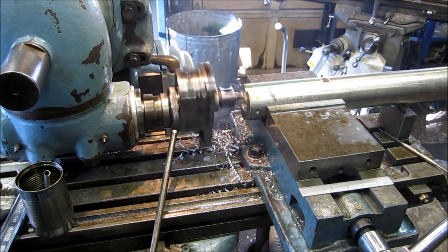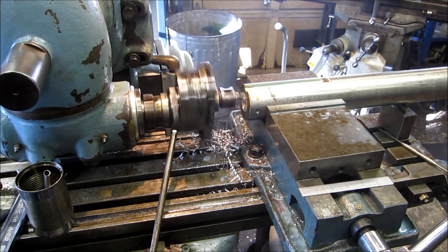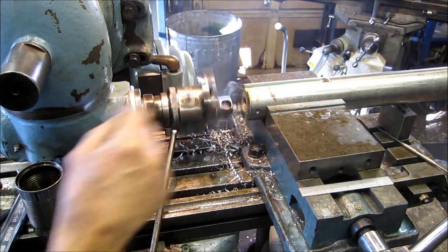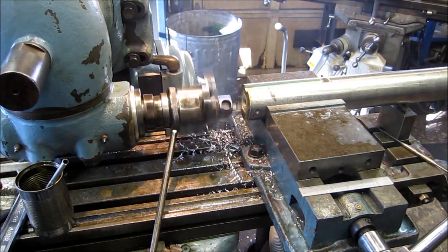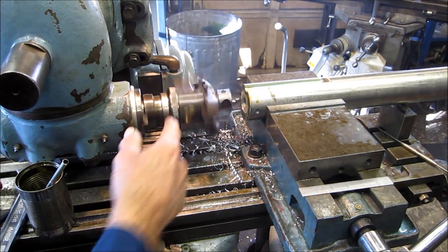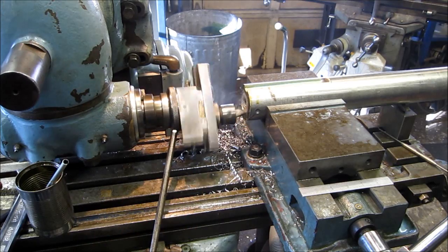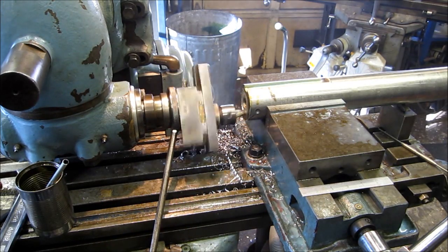Oh, we're back to operation, and the thing's running pretty smooth, but we did have more damage than just a broken screw there yesterday. We also found the Babbitt bearing that supports the thrust of that screw came dislodged, and we had to relocate it. We have several things that we really need to get back to and repair on this thing, but we got it functioning now. We get the job done, and that's the name of the game today.